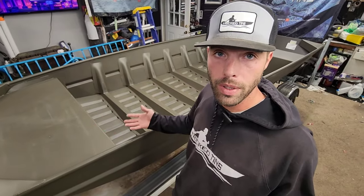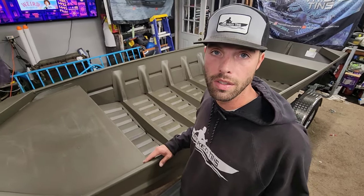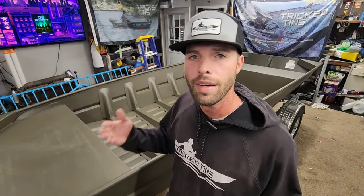You literally start your build with hundreds of holes in the boat from rivets. I guarantee those rivets will eventually leak. A lot of people won't tell you their boat leaks, but it does happen — it happened to me. Every single riveted boat I've ever owned has leaked. So do yourself a favor: if you're going to put a lot of money into a boat, start with a welded hull. A lot of my builds end up being five to fifteen thousand dollars, and I'm not going to build that out on a riveted boat. Those hulls are thinner and it's just not my cup of tea, but to each his own wherever you're at in your boating journey.